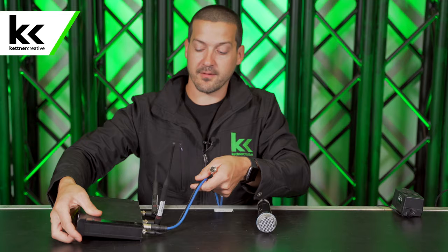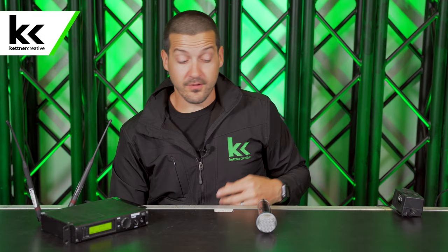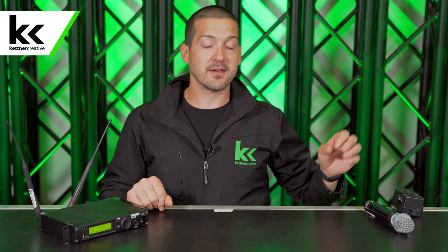Before you turn on microphones, you need to find out what wireless activity is happening in your area. It's very common at big convention centers that there will be tons of other units just like this operating at other conferences. Even in a downtown hotel venue, you'll get radio interference from other hotels across the street. These systems have a 300-foot line-of-sight range, which is impressive, though they do go farther but less reliably. You need to find out what other microphones are operating in your area.